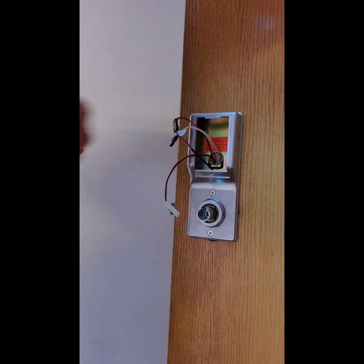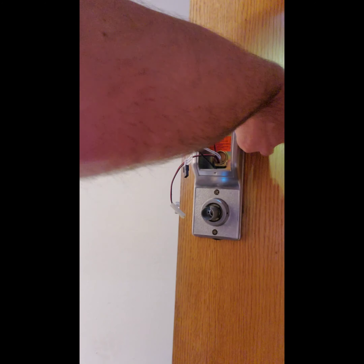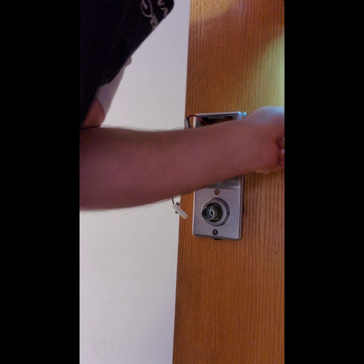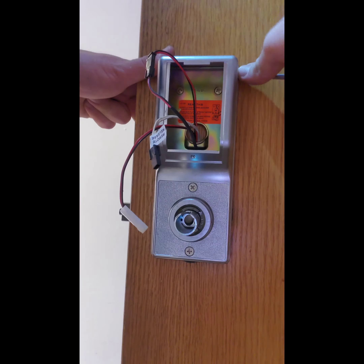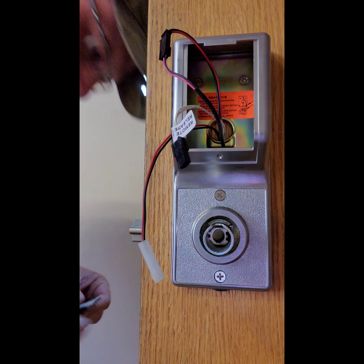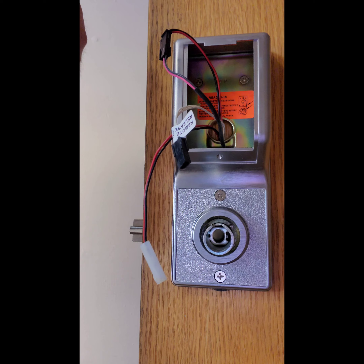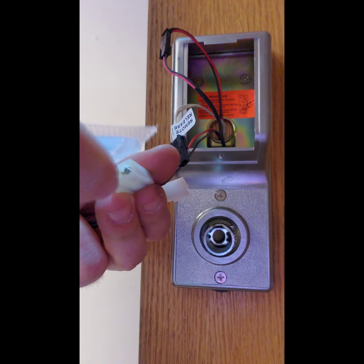My personal belief: I use the impact driver to do the work — that's the whole point of buying them. If you're careful with them they can be used, but there is a learning curve. Now there will be two screws mounted on the upper portion. This is why you leave that internal plate a little bit loose so you can get these to line up. This is a very important process — you will be backing the screws off if you do not follow that process. Now that the internal portion is perfectly mounted and all of the screws are tightened, you can suck everything down and begin to plug in the electronics.